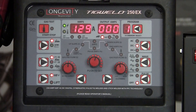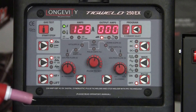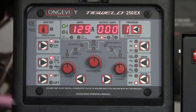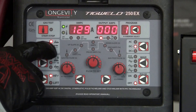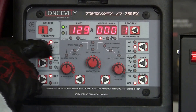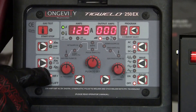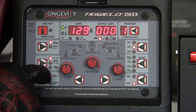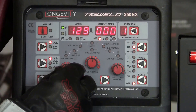Now that we've got the water cooler all hooked up to the water-cooled TIG torch, we're ready to go. We're going to go over our setup on the controls on the face of the machine. Starting with the basics: the top function is TIG torch, the bottom one is stinger for stick welding — you want it on TIG torch. Then the middle selector has three settings: 2T, 4T, or the bottom one which shows a TIG torch icon. I always go with 2T because that's your basic TIG torch setup.